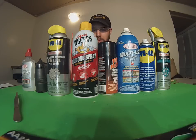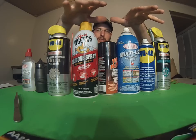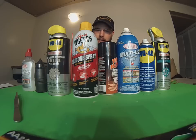That was fun. I hope everybody learned something and now the truth is out there — you can actually see what it looks like. Remember, the worst things for locks are heat, water, and dirt. Any lubricants that have oil-based components are going to attract that kind of stuff and break down in the heat. The only thing they provide is some resistance to moisture, but it's kind of not worth it in the long run. Thanks for watching, check out the website below, please subscribe, and stay tuned for more testing on other products.